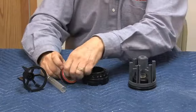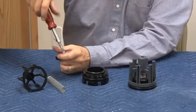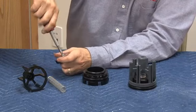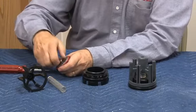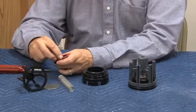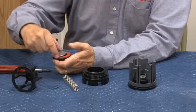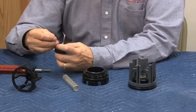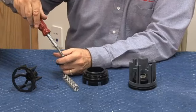One screw holds the disc into the disc holder, so to replace the disc, you would just tighten this down, loosen the screw, change the disc, like this. Disc is symmetrical, meaning that it can be turned over if you didn't have parts to replace, but obviously you should replace the disc if you're rebuilding it. Reassembly is going to be the reverse.